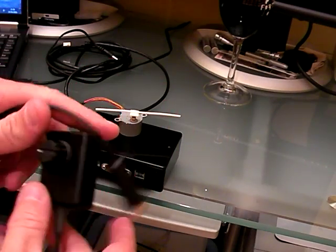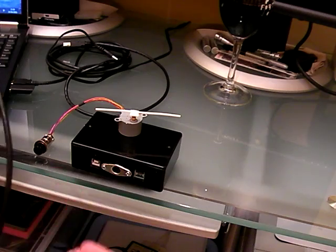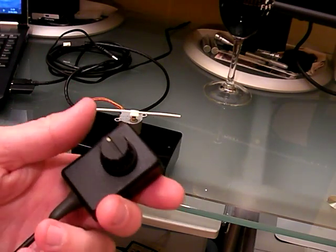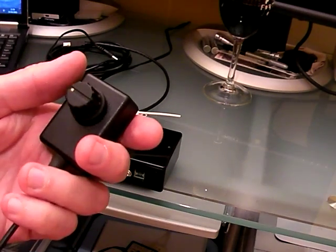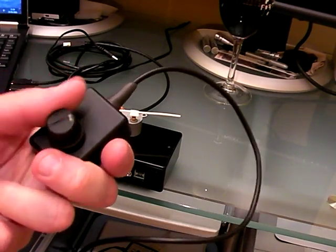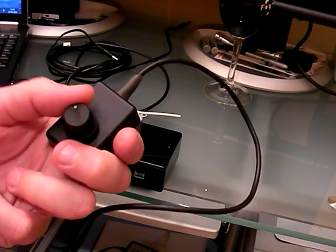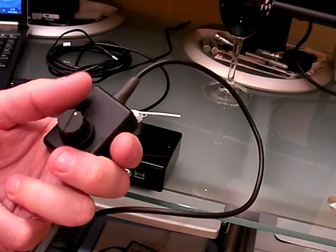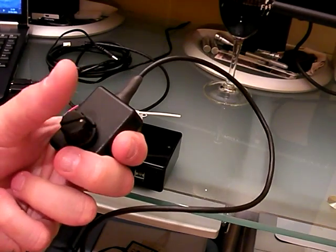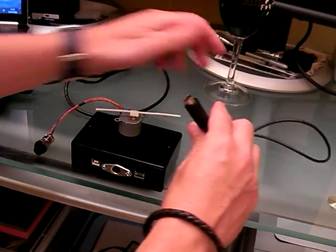This is the manual focus controller, separated from the box to minimize the amount of scope vibration when operating the manual focus motor. It's a quite tactile little multi-turn two-bit gray code encoder with a center button switch.